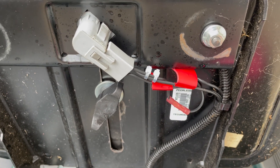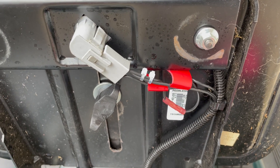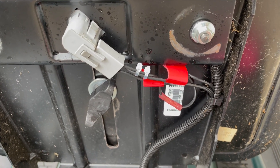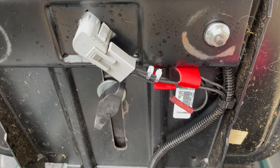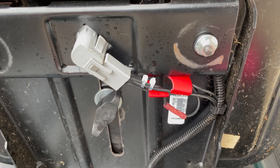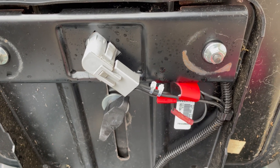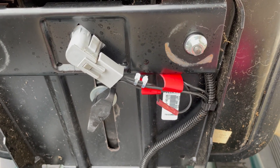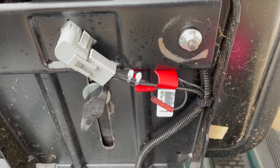Even if you're sitting on the seat and you let off on the brake or engage the PTO, it would kill the engine. Once that spring was removed, everything ran fine. It must have gotten dislodged somehow and shorted out the contacts even when it was plugged into the seat switch. Kind of an obscure problem, but maybe this will help you out. Thanks for watching.